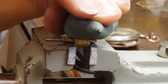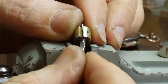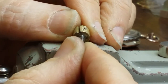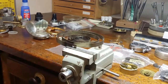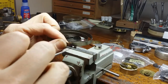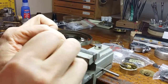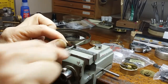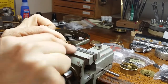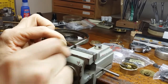You're going to see here the shape of the barrel hook or the arbor hook, and you'll also see the slot that the previous repairer had filed into it. That hook is about the way it should look now. When it came to the mainspring, it was entirely too long, so it required me to cut it short. Just like the arbor has a hook that grabs the mainspring, the outer coil has a hole cut into it and the barrel itself has a hook which that outer coil grabs onto. So here again, more filing with needle files to shape the hole and the very end of the mainspring.